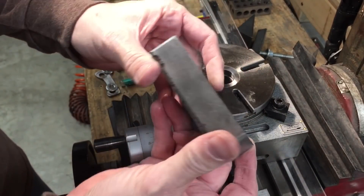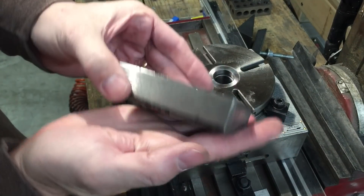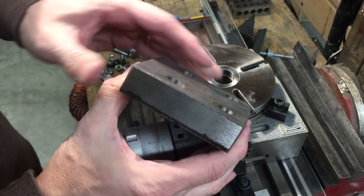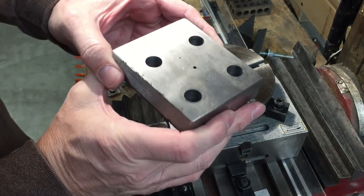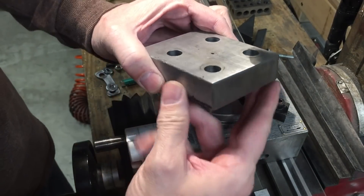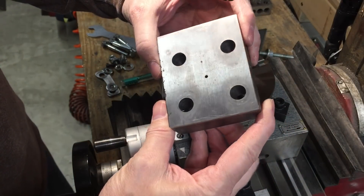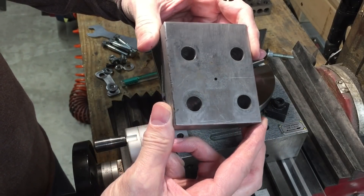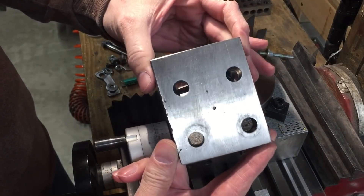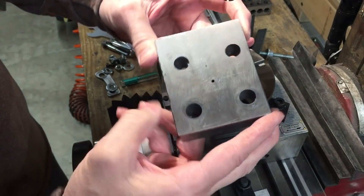This plate right here is really just a block of steel. I put it on the surface grinder and ground it down parallel — top to bottom you want it parallel. If it were raised and you rotated it, it would cut a higher spot on your liners on one side than the other. Basically it's just a block of steel and I drilled four holes in it.